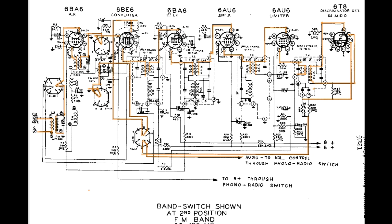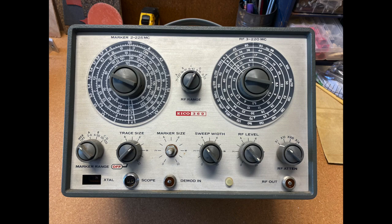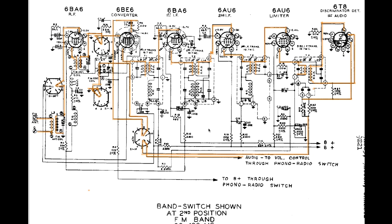I decided I wanted to go ahead and invest in an FM signal generator, and I found what I think might be a good deal on eBay for a used signal generator. But you never know, do you? Anyway, it was nicely wrapped, but I haven't cracked the package. Here's a picture of it. This includes a sweep generator. I haven't done a lot of FM alignment, but I'm told that sweep generators were useful. But what I am going to do is just use it to generate this 10.7 megahertz intermediate frequency. And once I get that running and can do that, we'll come back to this chassis and we'll see how to align the FM section using the 10.7 IF,